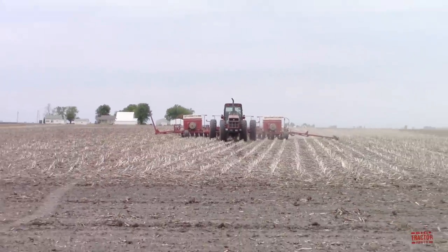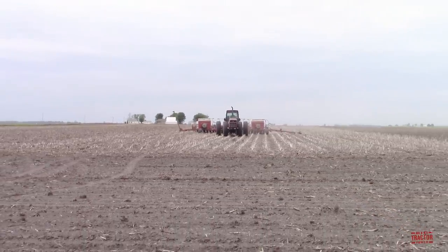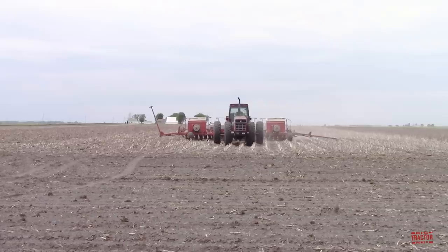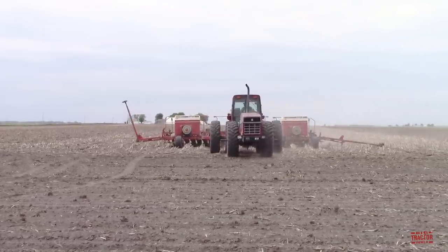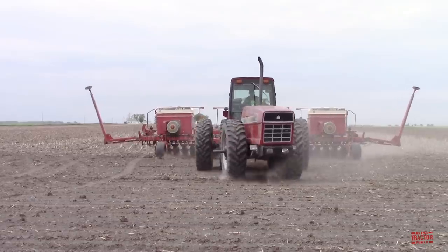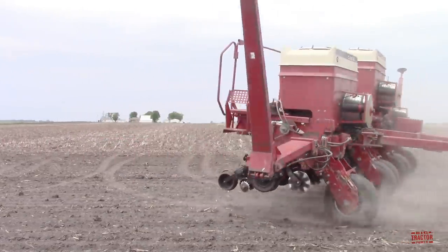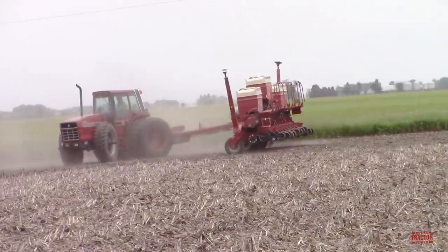International Harvester introduced the 2 plus 2 tractor design in 1979. This tractor was built to give the row crop farmer better traction, ability, and visibility in the field. The farmer sits in the cab, mounted right over the rear axle, where the operator can have a better view of the implement behind the tractor. The tractor bends ahead of the cab so that the front forward engine can give the tractor heavier and better traction on the front axle, as well as having a tighter turning radius when the machine turns around for the next pass in the field.